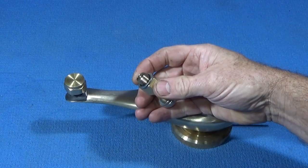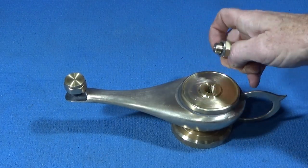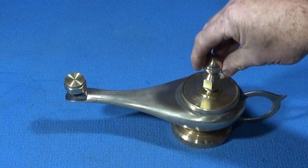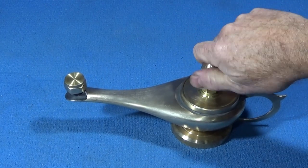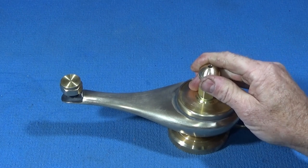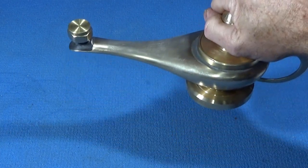I've got a quarter-inch BSP thread that I make normally for these lamps — I use either quarter-inch or one-eighth BSP. I used quarter-inch BSP on this one to have a wide enough diameter to fill the lamp, with a quarter-inch BSP Dowty seal to seal it. This could also be used as a handle to carry the lamp. It's quite heavy now — just about one and a quarter kilograms — so it's much nicer to hold it by the ball to carry it.